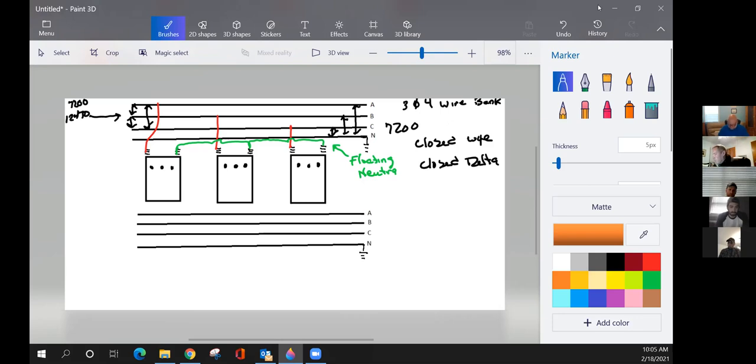You have this type of bank where it's a delta connected bank. These transformers have designated names to them. This middle transformer, we're going to call it a lighting transformer. These outside transformers are going to be your power transformers. What's another name for the power transformer, Professor Shoemaker? High leg. That's lighting. Not lightning, lighting. High leg equals P. That's your power transformer or your high leg.